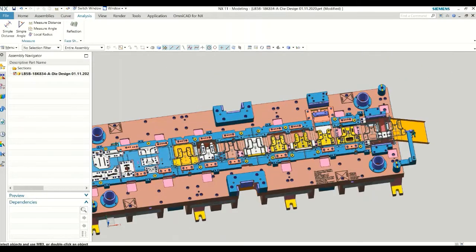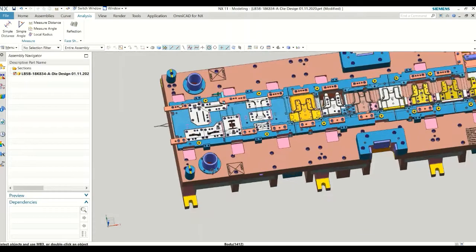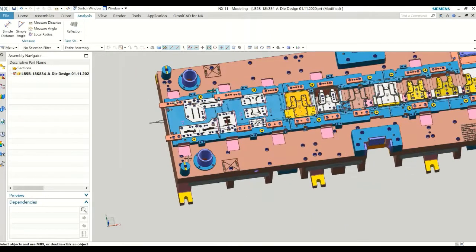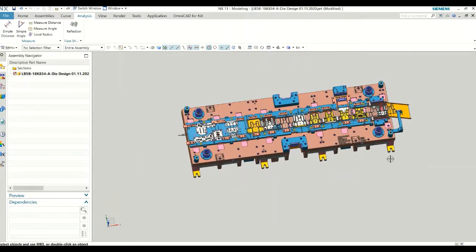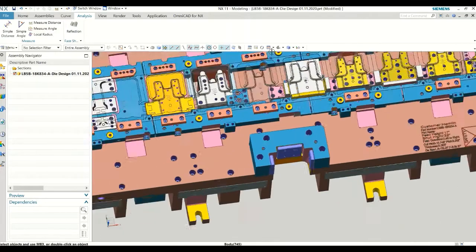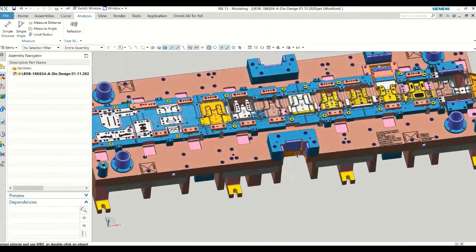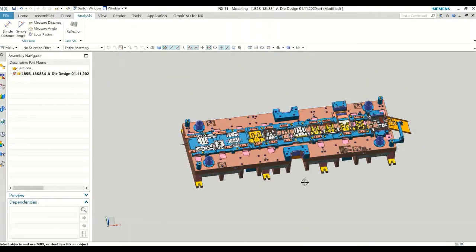These four are nothing but guide pins and guide bushes. Guide bushes for the upper die — it has multiple forms to control the forces. We have these two lower guide blocks. We have a guide post in the upper which comes down, and that is the way we try to balance and take out the lateral forces because of the shape of the part.